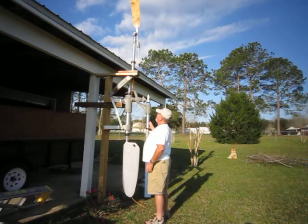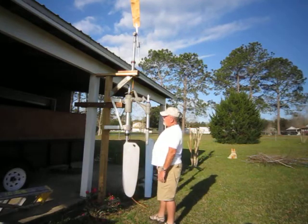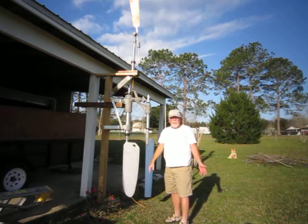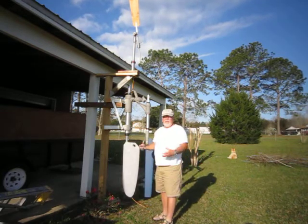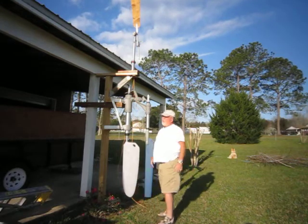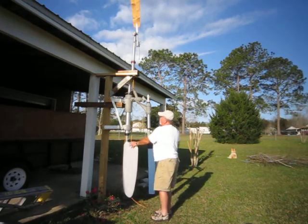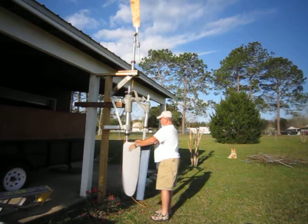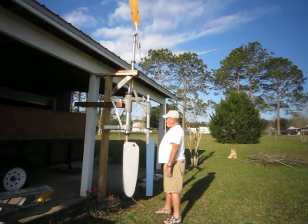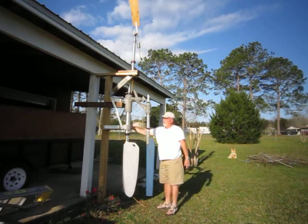The secondary rudder turns the primary rudder through this arm mechanism right here. Now if you'll notice this black handle — that is for emergency steering should the yacht's rudder fail. You can reach back, grab the primary rudder control, and turn it on its own right or left. It turns very easily, as you can see. So that's how the mechanism works.